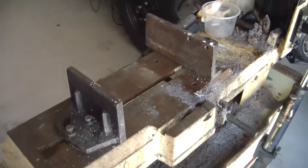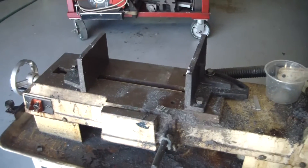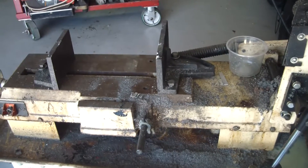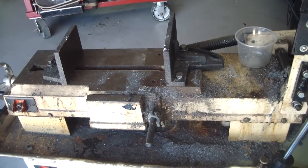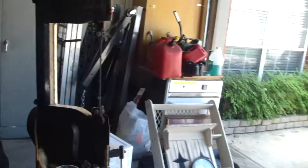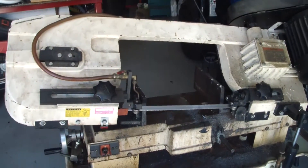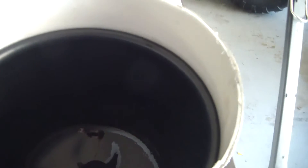I was going to use a cutoff wheel, then I thought let me see if it'll fit on my horizontal bandsaw — and it did, it fit perfectly. It literally took me less than five minutes, probably about three minutes, to cut the top off. For those of you who don't know how this works: you put whatever part in, turn it on, drop the blade down and it just slices right through metal pipe, tubing, you name it — sliced through this like butter. I didn't want to fight with it very long.